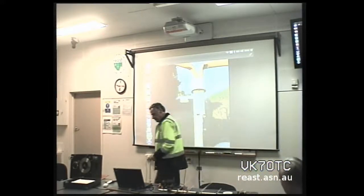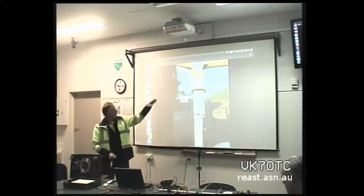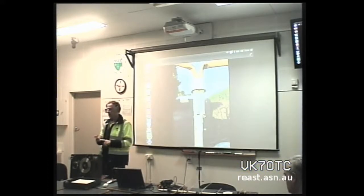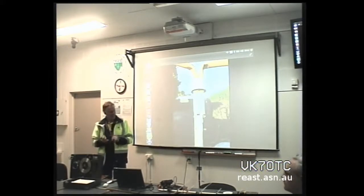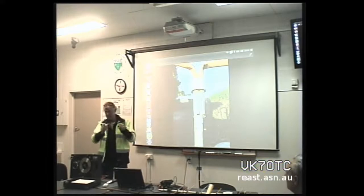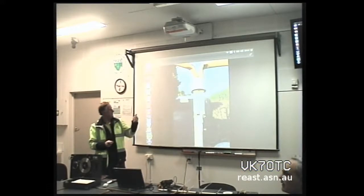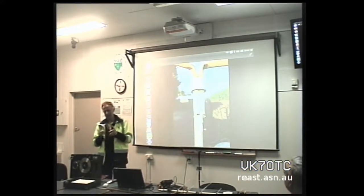It's a neat bit. But therefore, by moving the trombone in and out, you can tune the antenna. Now, our good amateur, who's not sure with the VK3, work out that... I've looked it up, Steve. Okay. VK5JC, who built those analysers, by the way. So he worked out that a length of 3/4 inch copper pipe per metre is around about 66 picofarads.